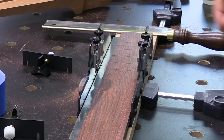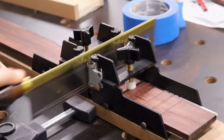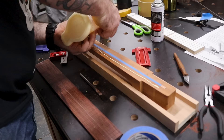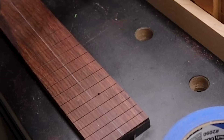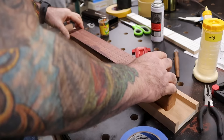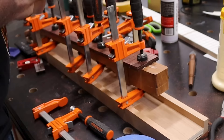I'm using rosewood for the fretboard. I cut it closely to thickness and then used the drum sander to sneak up on it. The thickness ultimately is going to be a quarter of an inch — I went ahead and cut it to five-sixteenths so that I would have some room for sanding. A fret slotting miter box helps you set the depth for each fret, and along with a little jig, it helps you cut each fret precisely. Once you've made your fretboard, you want to get it glued in perfect. One trick is to drill small holes through a fret slot near the bottom and near the higher frets and use those as registration points so that when you glue this up, it glues in nice and straight.